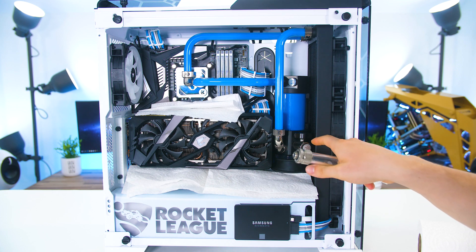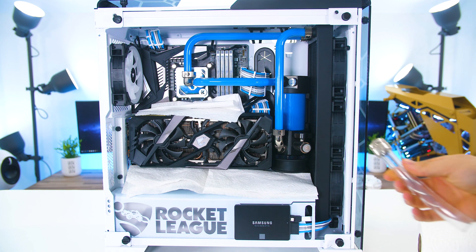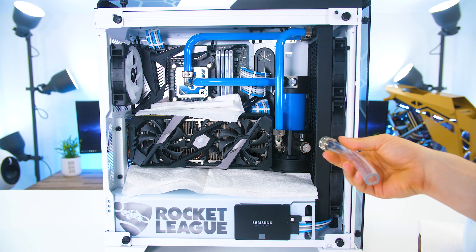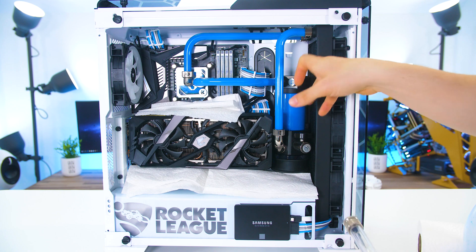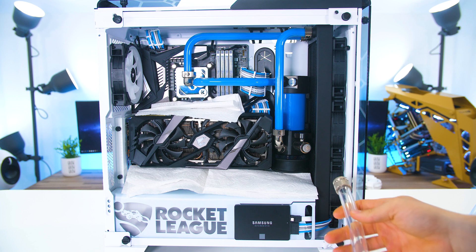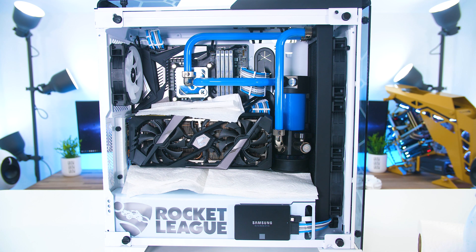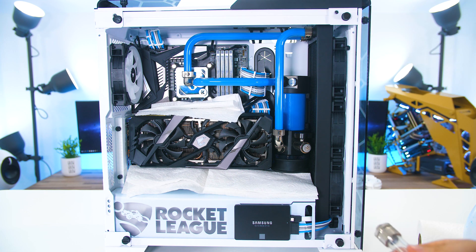Our plan is to take off the stop fitting right here, leave the valve closed so no liquid comes out, screw on our soft tube fitting, and get our bottle ready to catch the liquid through gravity. Once the tube is on and the bottle is in place, we open the valve. The liquid will start trickling out slowly at first, then we release one of the ports at the top of the reservoir because the liquid needs air to replace it. Once we open one of those top valves, you'll see the liquid gushing out fast — it only comes out slowly to begin with because it needs that air in there.